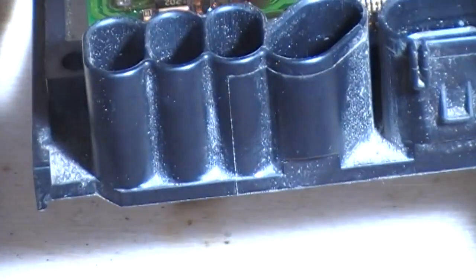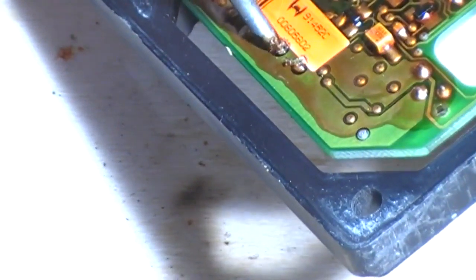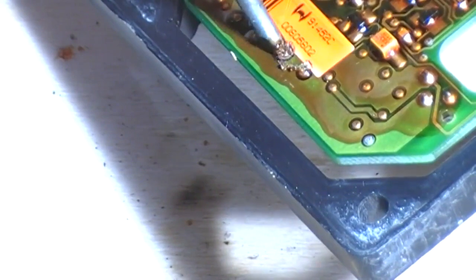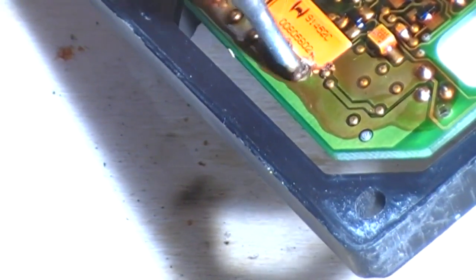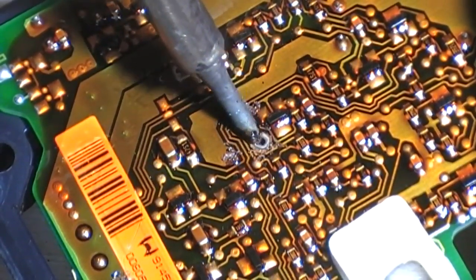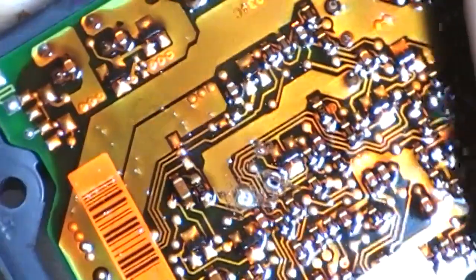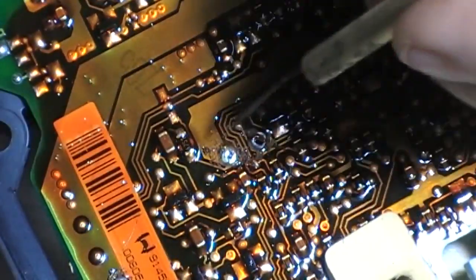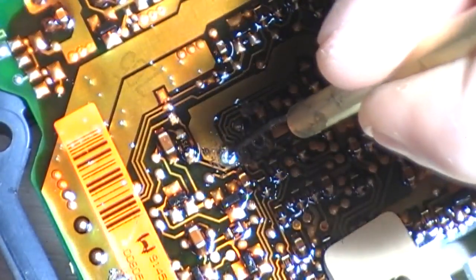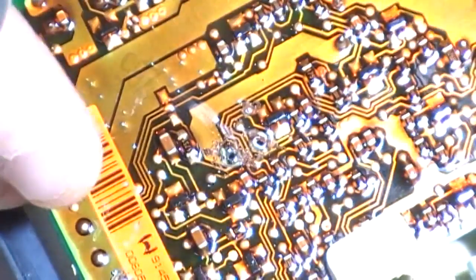Now that one always is quite hard to get at. What we'll do is we'll clean the mask around where we need to solder. Best thing to do this is heat. And in the middle there, always trying to remember to stay in shot. Clean iron. Now my hole de-picky tool in the hole, heat my tool, in it goes while twiddling, and then that's a free hole.